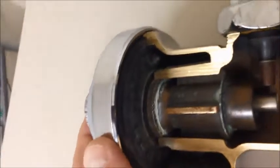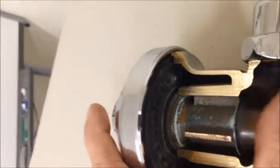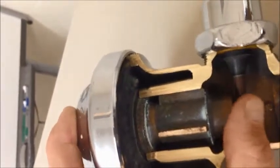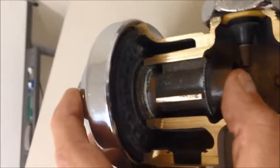And then over here is your diaphragm type flush valve. Now it works on the same principle. You can see that I've got this bypass right here, and that's built right into the diaphragm. Up on top, there's a larger surface area — it's pretty easy to see in this type. All I've got to do is move that center relief valve.